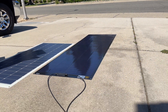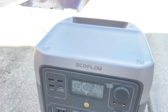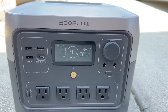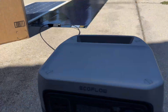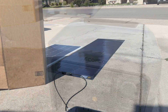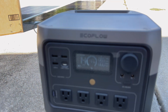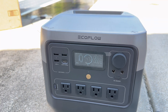Now let's see how the SIGS solar panel handles shade, since it's supposed to perform well. Baseline test: about 155 watts. With the same sliver of shade, it's now about 145 watts — very similar to the Renogy at that level. But at the shade level where the Renogy was at 50 watts, the SIGS produces double that. And where the Renogy was completely dead, the SIGS is still producing 65 watts — actually pretty cool.